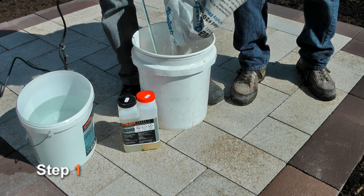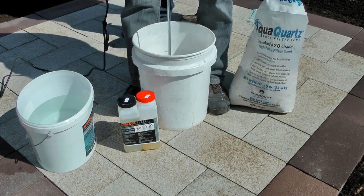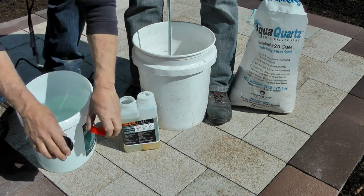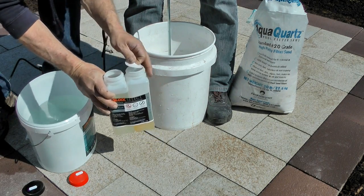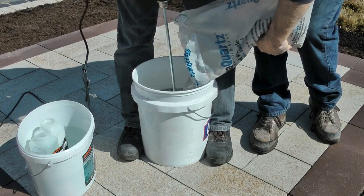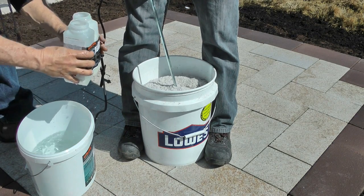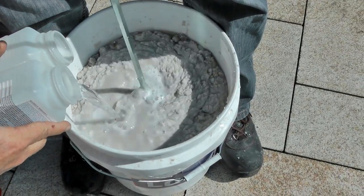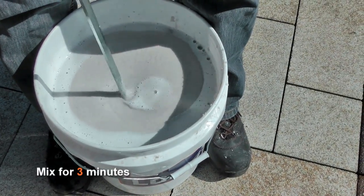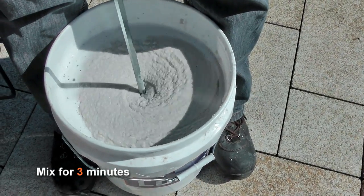Step 1. Always mix your materials in close proximity to your installation. The mixing is accomplished using a ½ inch drill with a mixing paddle attachment and a 5-gallon bucket. Place the paddle into the bucket, put all 50 pounds of sand into the bucket, and immediately pour the hardener and the activator in as well. You may want to have some help doing this. Begin to mix the materials and from a bucket of water use the epoxy containers to scoop water into the mixture, adding small amounts at a time until the consistency of the mixture is that of a soft milkshake. Mix for approximately three minutes. Always secure your mixing bucket so that it does not begin to spin or wobble.